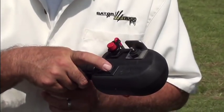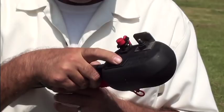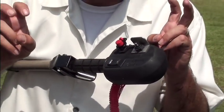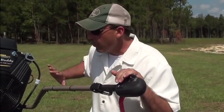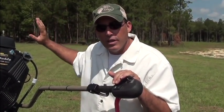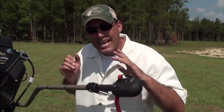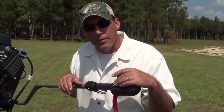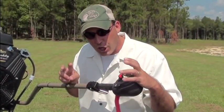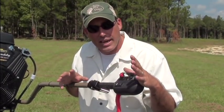This is a power tilting trim — you've got up and down. The trim is used as your four-wheel drive, per se. You can trim the motor out to optimum performance, throw your big rooster tail out behind you running down the canal, shut it down, talk to somebody, and take off again without ever touching the trim in most instances. The only time you're really going to use that trim hard and heavy is when you're stuck or if you have a really big load in the boat trying to take off, much like an outboard.